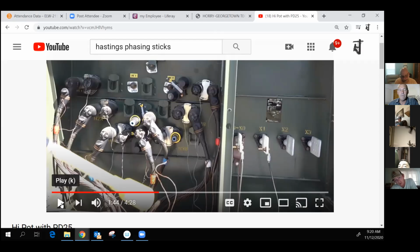So now you have whatever length of stick and kV insulation. Again, you're going to have some companies say no, but once a stick is introduced, and we'll go back to the overhead here in just a moment, you're able to go ahead and work it. You're not working hands-on. So if you get into a situation where somebody asks you to do some elbow movement in here and some of them are energized, ask for assistance.